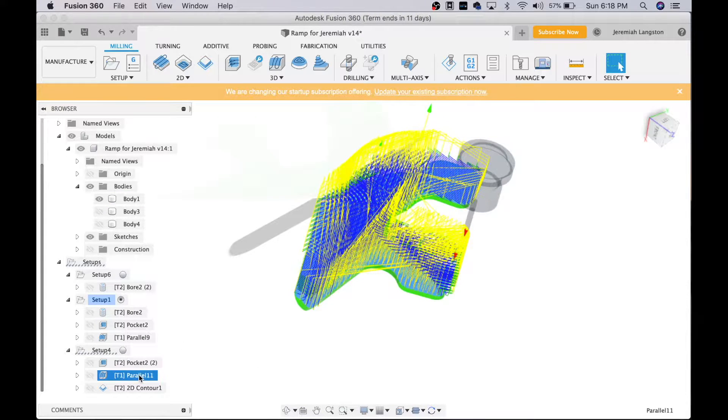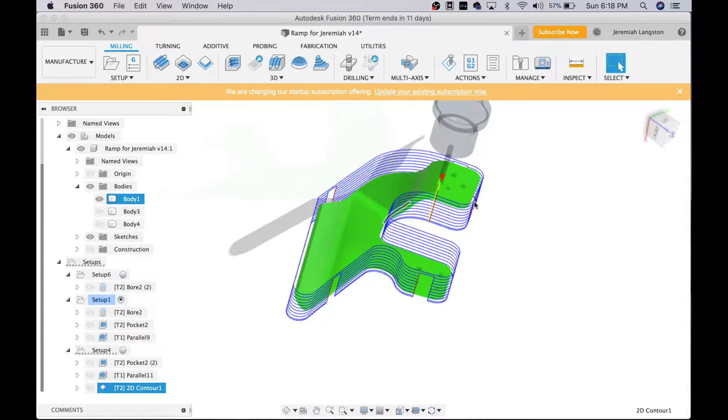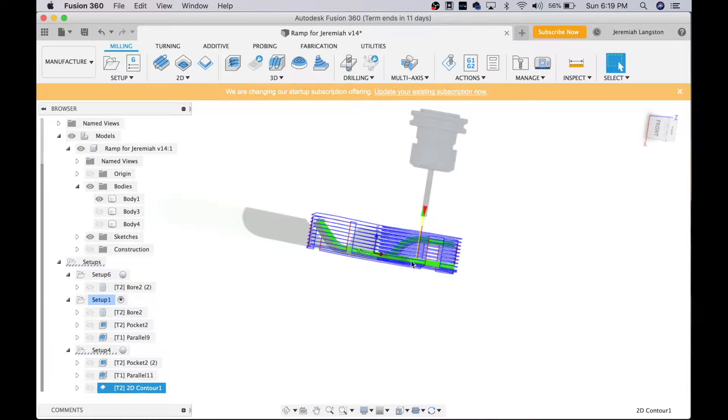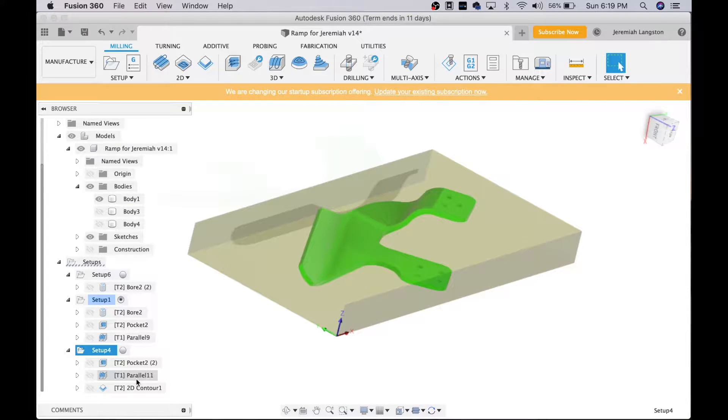The next mill operation is a rough cut to the bottom, then another pass with the ball end mill to clean everything up. Then I come back with a square end mill and cut this out. I use the periphery of the part as a projection for this 2D contour operation, and I put tabs in here — the tabs go all the way through the thickness of the part. That way you'll basically have a little piece of material holding it: the machine will step over those tab locations. It's going to be milling air for almost the entire operation, but it has to go through the full thickness, and at the end the part is suspended in the material held on by those tooling tabs.